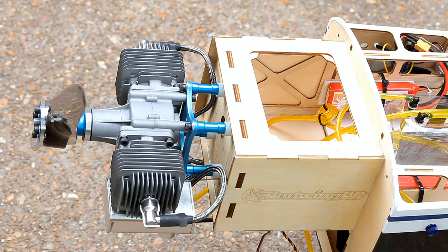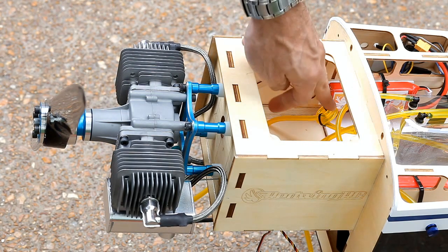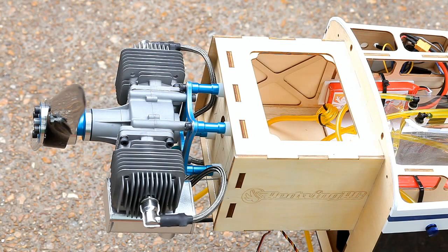I like to keep an eye on the fuel when we're first starting an engine, so you know the fuel is actually getting up there. It's really important because if you're just flipping away, you don't know what's going on. If you don't see the fuel actually going up to the engine, it can be really difficult to know if it's there or not — you'd have to take the spark plug out and see if it's wet or dry. It's just a lot easier with the cowl off.